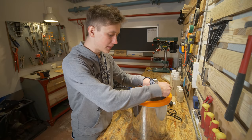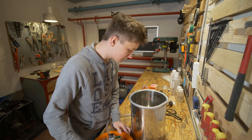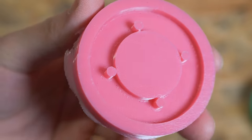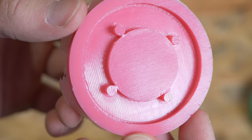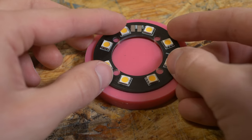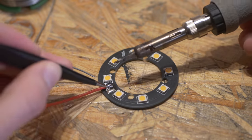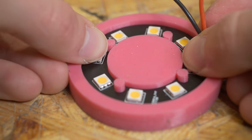Now it's time to open the valve. That is a perfect mold — it looks great. The mold turned out just so, so good. The PCB fits perfectly inside, and even the pins that protect the screw holes from epoxy are perfect. It is a really good idea to solder the cables now, because later it will be totally impossible.